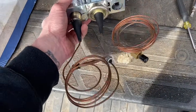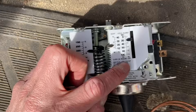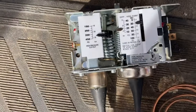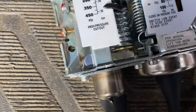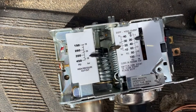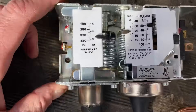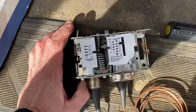Scrolls cannot pump down like other compressors. Basically, you hook up your flare nuts to where they need to go — either on the lines or the compressor. All this does is open and close: as the low side pressure lowers, this comes down and shuts off. You can also bypass it — put a screwdriver under this little piece here and pop it up for a pump-down if you really need to get it lower than what it's set for.